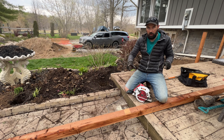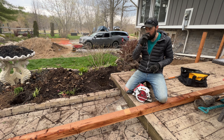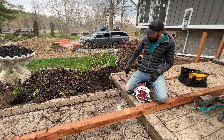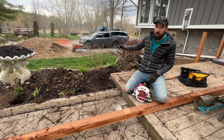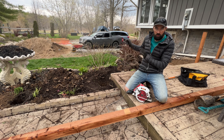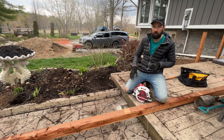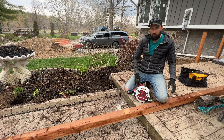So I've got my 12-foot posts laid out. I'm actually going to use each 12-foot section to make two posts, so I'm going to cut it in half at six feet. I've dug these holes so they're about two feet in the ground. I've got a foot of deck height and then I want my fence to be about three feet high. I'm basically going to see how the six feet looks in the ground and then continue that height straight across following the entire length of the fence.